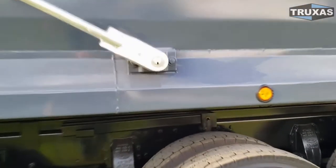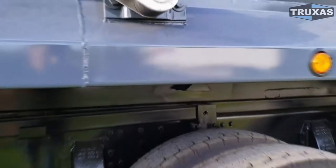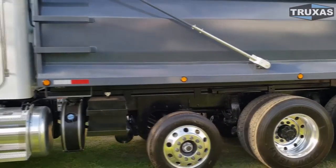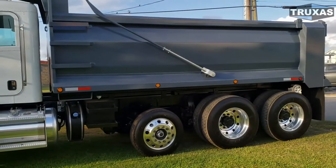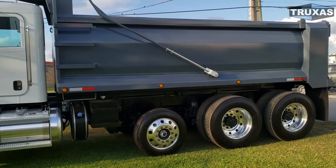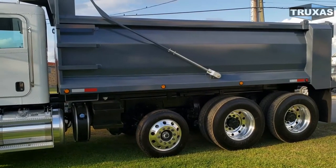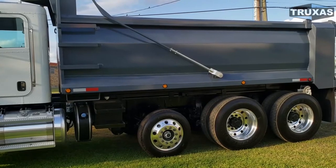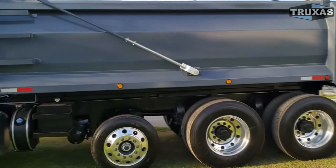On the bottom of this floor there are no cross members — that floor is the floor inside the bed as well. The only way to really get this one lighter is thinner steel. For a sand and gravel option, we could go down to 3/16ths floor and 1/8-inch wall — that's what we'd recommend for sand and gravel. You could put some broken asphalt pieces in there, maybe some concrete pieces with a little dirt on top. But really it's recommended for 1-foot minus pieces with the 3/16ths floor and 1/8-inch walls.